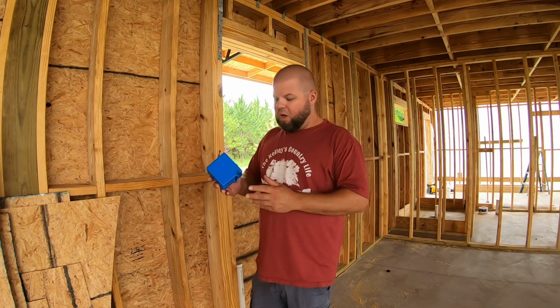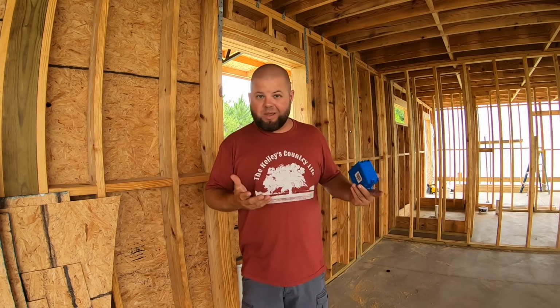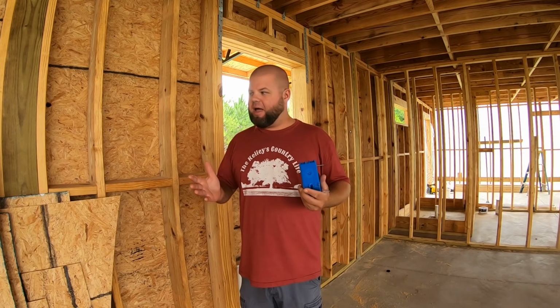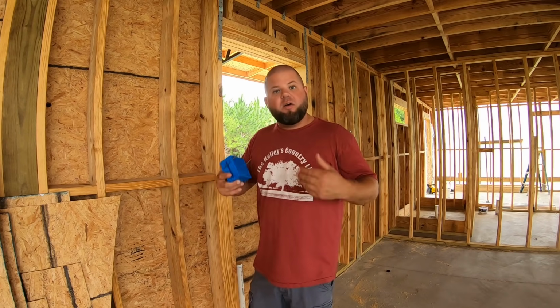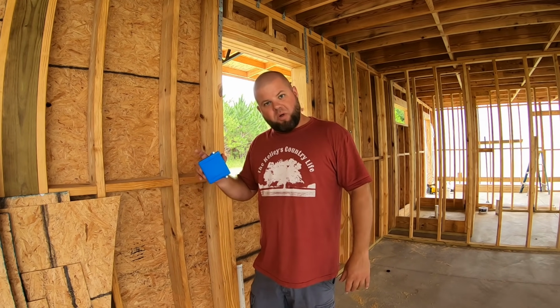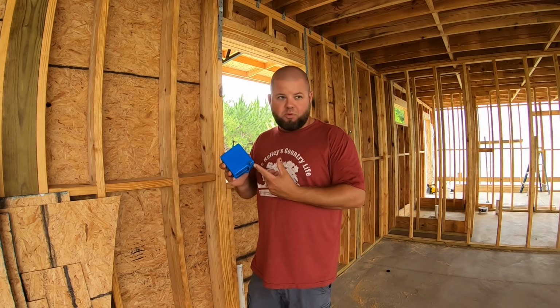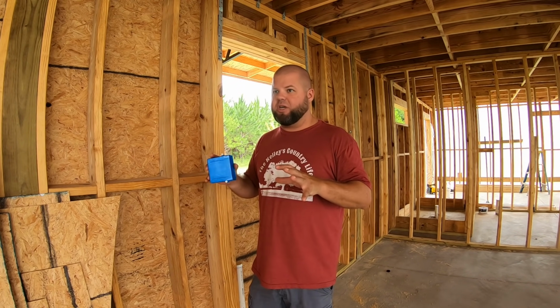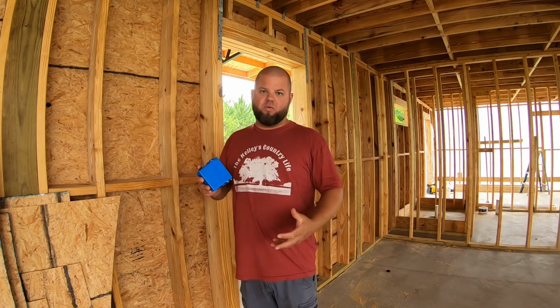I don't think so. But to meet the ADA compliance, because you could potentially be in a wheelchair down the road, and we're building the house just in case that were to ever happen, you want your switches a little lower for ease of reach while sitting. Now with the outlets, you actually want those a little higher. I'm going to do 16 inches to the bottom of the box, which is higher than most homes, but I think will look okay. I've been really looking at this. That way, if you were in a wheelchair again and bending over, you're not bending over as far.